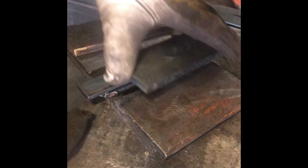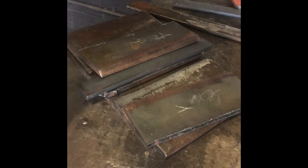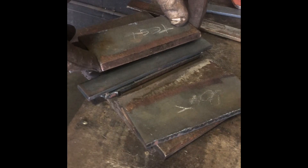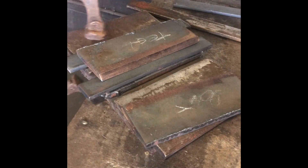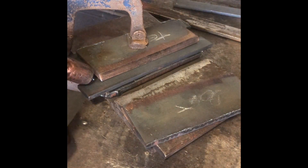So we're going to use the old jig here. You're going to lay it down in the center and clamp those in like that. Sometimes it's better to put a little piece under it, under your beveled edge — that actually looks better. Go ahead and clamp it into place. Always clamp that first one in. You can go ahead and get a tack on it while you're there so it doesn't move.